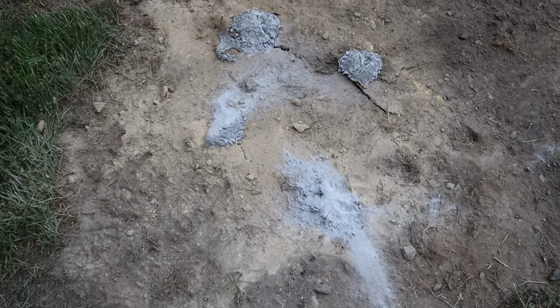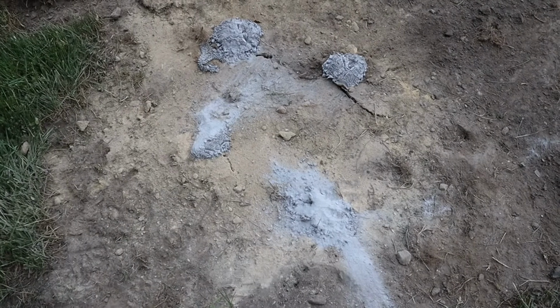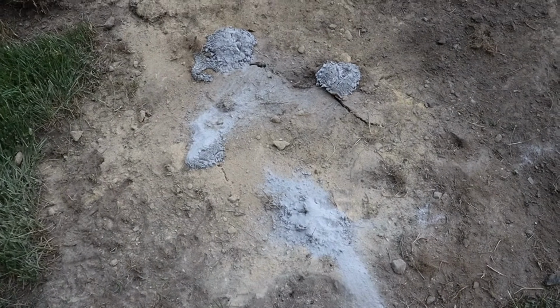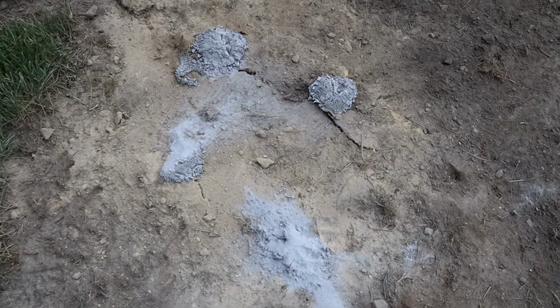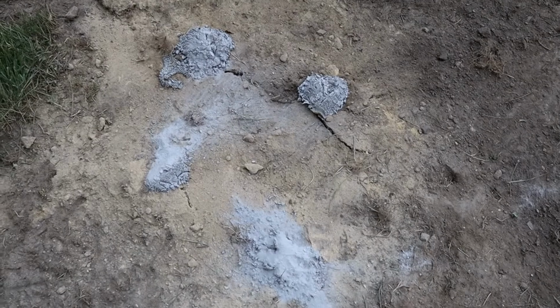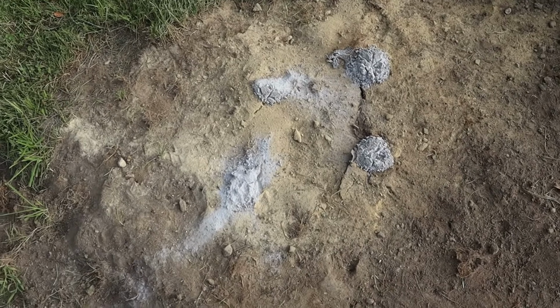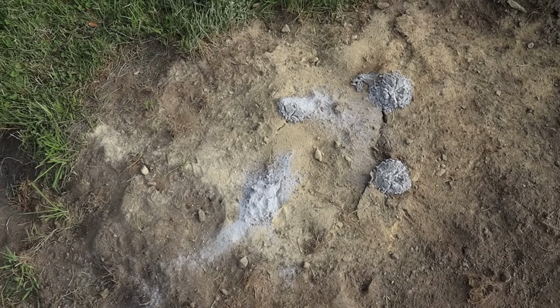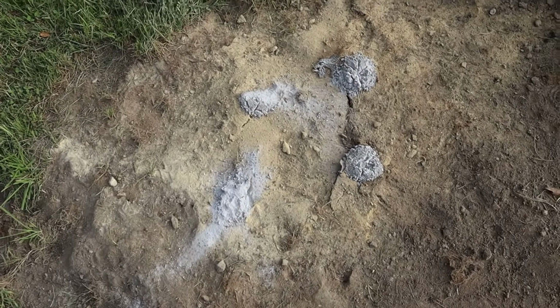This product did require that you drill 1.5 inch holes. What I did is I used the 3/4 inch bit first, drilled the holes down about 8 or so inches, and then I went back with a 1 inch bit and drilled them out, and then of course cleaned out the holes with the air. But I'm still impressed that it still busted it up even with a 1 inch hole. Hopefully enough damage was done to these rocks so I can hurry and rip them out. I'm going to use a tractor first and try to scoop them out. If that doesn't work, I guess I'll use the jackhammer.